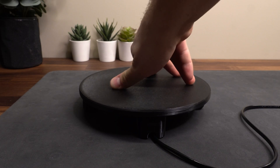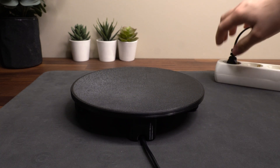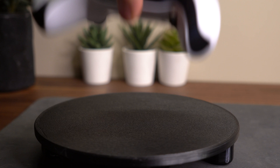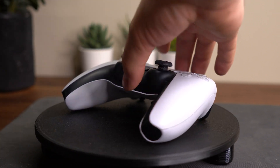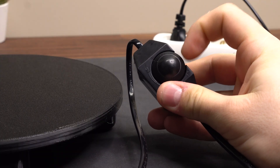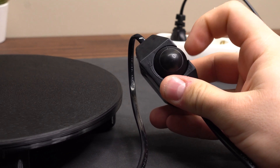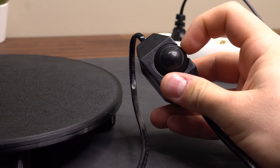Give it a spin to make sure it rotates freely, and as simple as that, the assembly is done. Now it's just a matter of plugging in the power cable, turning on the power, and it works — just like planned. Grab your favorite object, place it on the platform, and enjoy a 360 degree view. You may notice I'm using a dimmer switch — I originally thought this would allow me to control the speed, but this motor seems to only have one speed. When I adjust down the power it just goes crazy and switches directions, so I'd recommend just using a regular on-off switch.